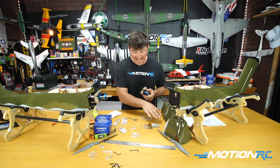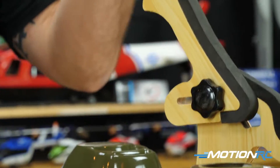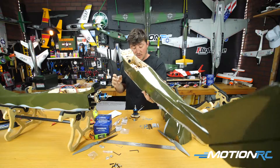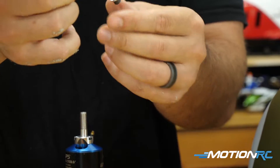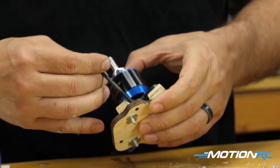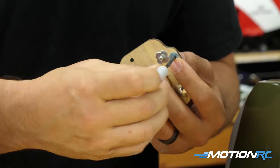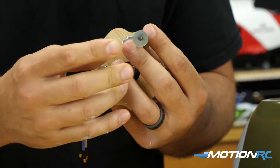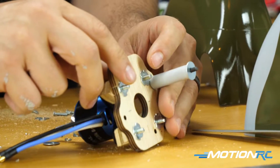Now coming back to all the parts from the kit, we're going to load them up. The blind nuts are already installed on the back of the firewall, nicely glued or siliconed in — they're not going anywhere. Take one screw, add a spring washer and a regular washer, then send it through. Then go larger washer, spacer, and the biggest washer up against the firewall. I made all four and sent them through at the same time — line it up and it works pretty easily.